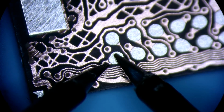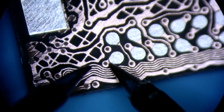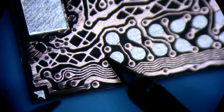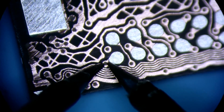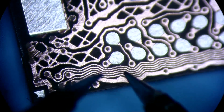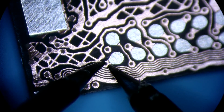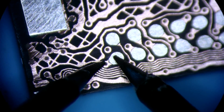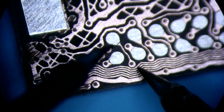We see they're not buzzing because that line right there, that's where the salt started to interact with copper and it rotted all out so that it completely separated. You see, if we were holding them together, we would get a beep. But as soon as we go onto the pad, which it was part of before, we're not getting any beep.